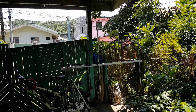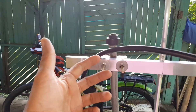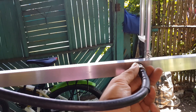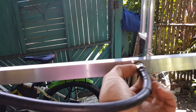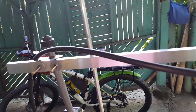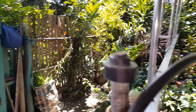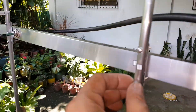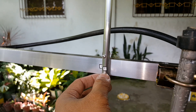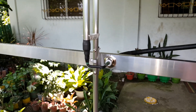This is a four-element Yagi going to Negros Occidental. Let's check the antenna configuration. We have the mounting bracket, the SO239 feed point connected to a PL259 connector going to an RG8 coaxial feed line. Each element is secured on the mounting bracket with bolts and nuts, attached to the boom. Each element is marked with numbers, so I just need to put back the corresponding elements with their corresponding numbers on the boom.